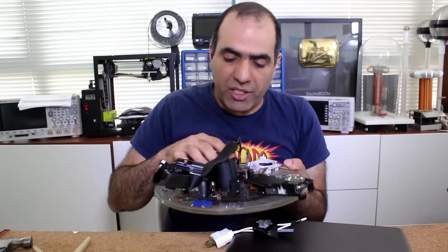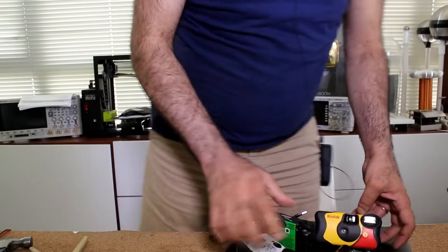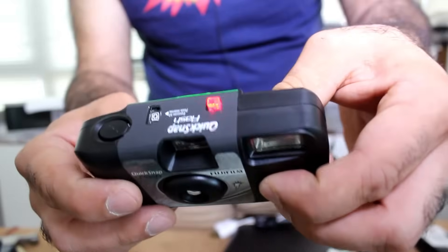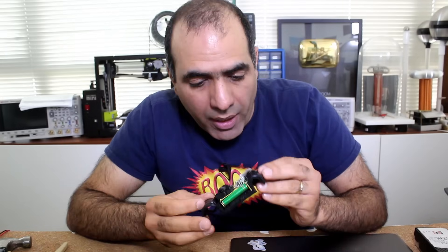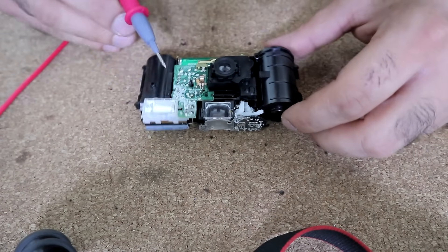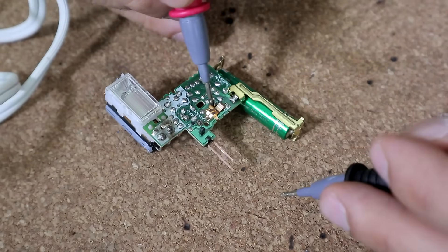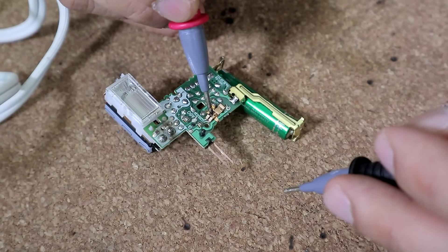You want it to be battery operated? I guess we could use the same camera to charge the capacitor, but I totally broke it. I'm back with four disposable cameras with flash — I picked these up from my local photo studio where they recycle them. The circuit works fine with battery and everything. Now, the capacitor charges up to 300 volts. This stupid flash capacitor is still charged — let's discharge it first before touching it. These things are violent. I figured out how it works: you close these contacts for the flash to charge, and then you close these two to make it flash. Ow, my eyes! So really, all you need to do is wire the USB data lines to your flash, and every time you take a picture, a computer dies. Chikaboom.